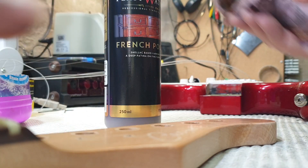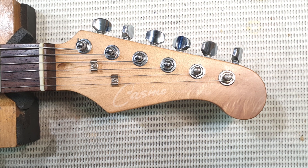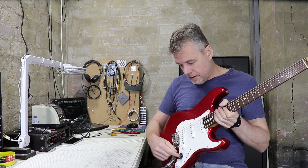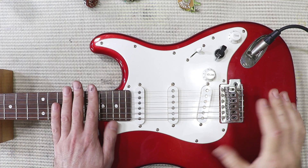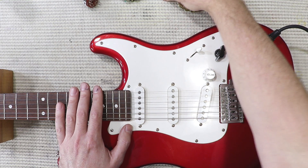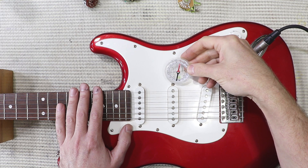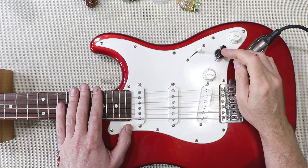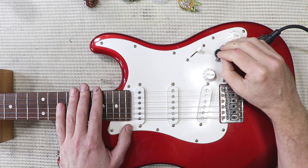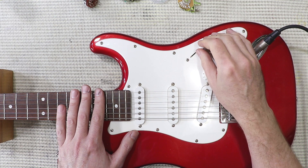You can still actually see the logo because of just how UV-affected the poly has become over the years. The main mod I have done is this three-way rotary switch. I'll put it on the bench and show you what's happening. The guitar's got the standard Strat setup with three single coils, and the middle coil has reverse magnetic polarity. My mod switch has three positions — it's a three-position rotary switch — and when the switch is in the middle, the Strat works just as it should with its five-way switch.